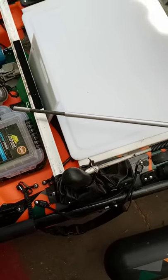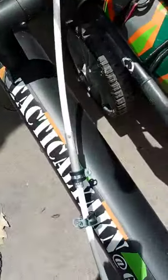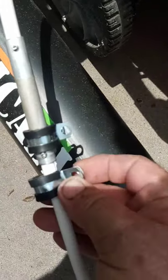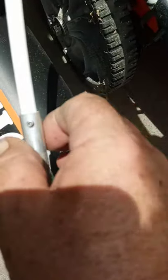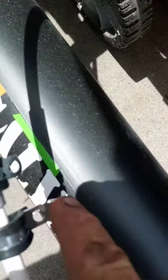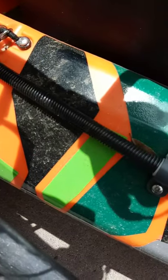Come to the middle of your cable and find the little piece of aluminum with two set screws in it — you'll have two of these with your kit. Put that on the top surface of your kayak. When you get it, this piece will be able to slide, so you want to set it on the top surface and then screw these down and lock it in place. That stops your cable from moving back and forth under pressure. Honestly, the farther forward you can put that little aluminum piece, the better off you are, but midway is fine.